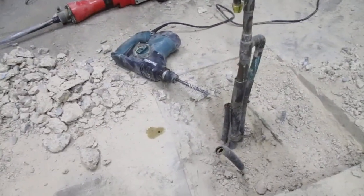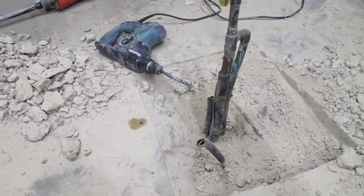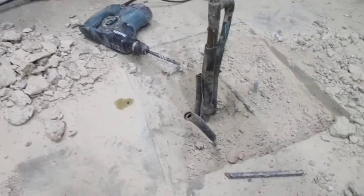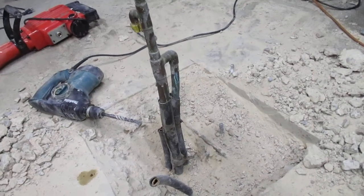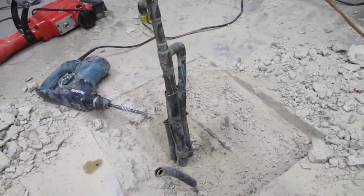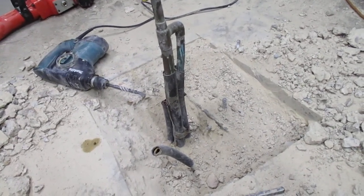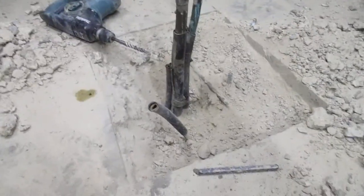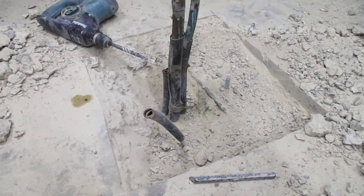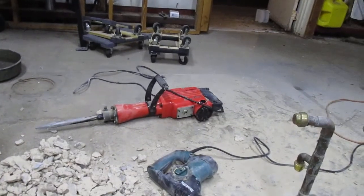It's still the 10th of November, about 8 o'clock at night. This was my last project I wanted to get done today. I got this riser for the main water that comes up above the floor, and I'm trying to get all open floor space with no impediments. So I had to cut about a 20 by 20 in the concrete with a diamond blade to find the edge, and with my Extreme Power jackhammer — the red thing over there — start busting out concrete.